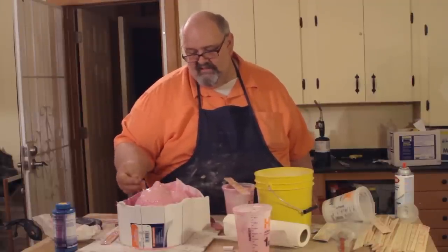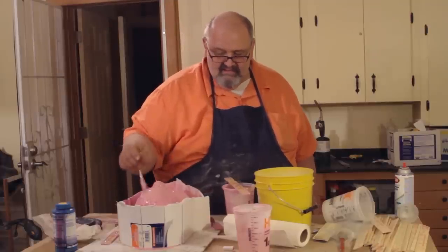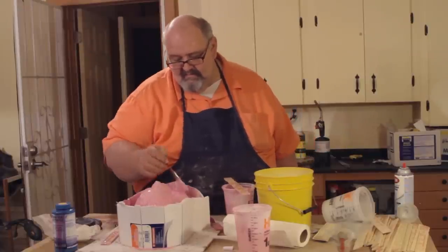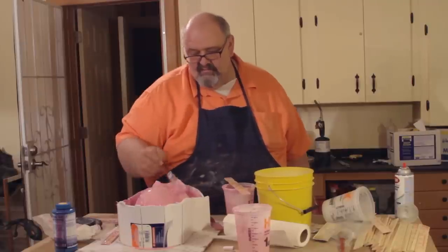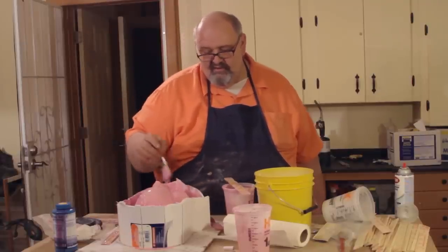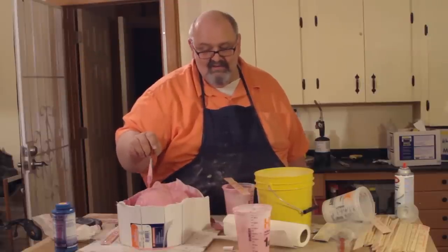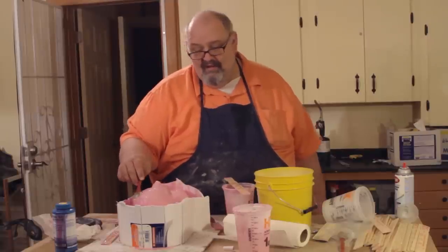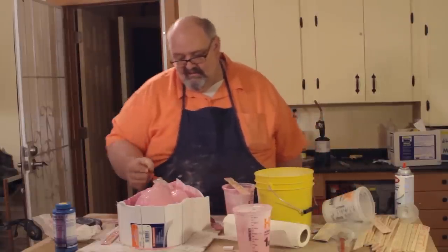We just want it to be consistent. And so, like I said, right now it's just going to keep on falling. So I'm going to wait a couple of minutes and come back to it and see where it's at. And just don't let too much time get away from you, because if you do, you'll come back and it's solid and you've only got 1/8 of an inch or less of rubber on the high spots, and then you've got 2 inches thick rubber on the low spots, and you don't want that. So we'll go ahead and pause here and come back in a little while.